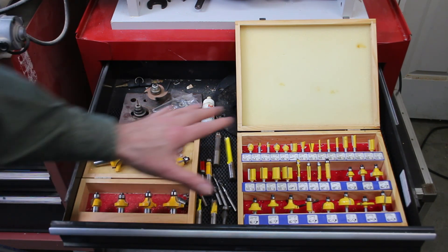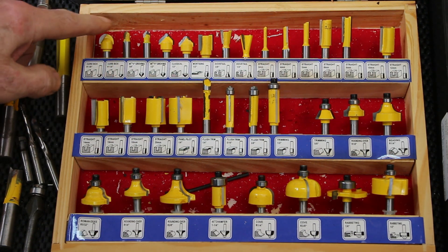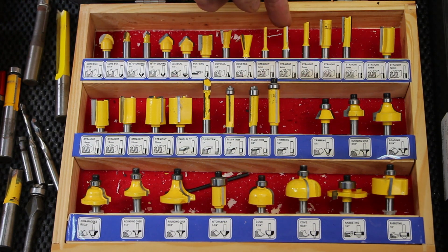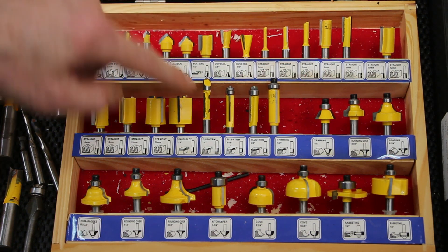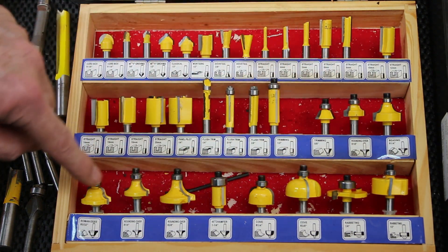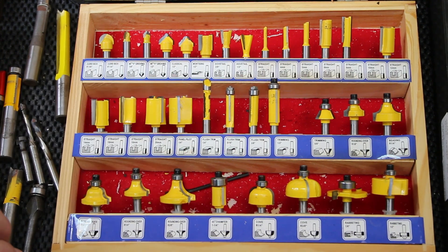All these different contours — I'll come in a little bit closer. Just think of all the things you could do with some of these router bits: making hollow grooves, pointed grooves, dovetails, slots, big removal of waste material. These are bearing followers for removing off edges by guiding onto something, of course. So all of these have bearings on them.